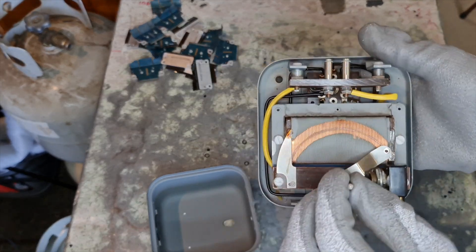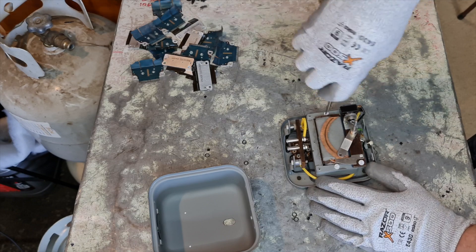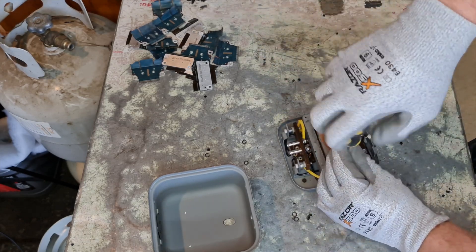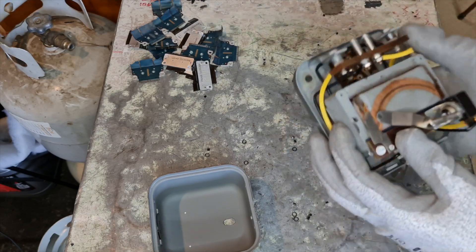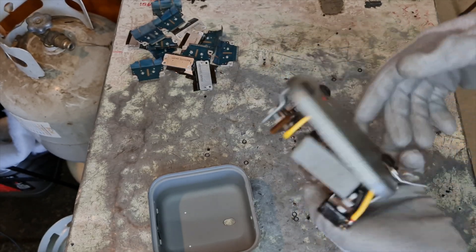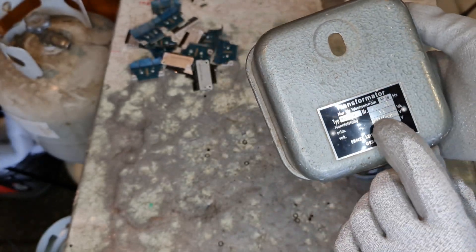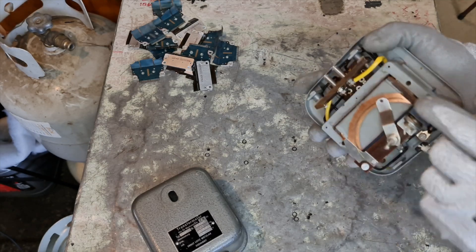It's also going to be quite a meticulous thing to scrap out, so what we'll do is try and take off the biggest pieces first like this transformer. It's a transformer that you can manually set, manually tap - by tapping it you can increase or decrease the voltage on the secondary side. The primary side is still going to be 240 or 250, but through here you can wind it up. I think it was two to seven volts on the secondary.